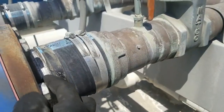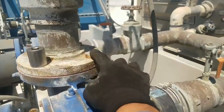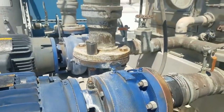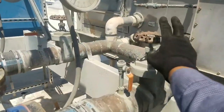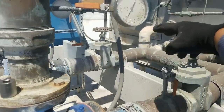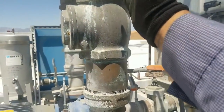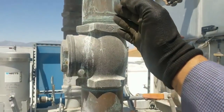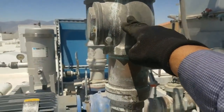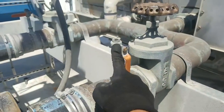Because we're just going to slide out this entire pump and motor all in one shot. We've got to loosen four bolts up here, and then that'll separate these right here. So right now we isolated the gate valve — we shut the gate valve off. And then this is the check valve here. This check valve is only one directional. So what we're going to do is we don't have to close this gate valve because the check valve is actually doing its job, and we drained it out by this right here — we opened it up and let it drain out.